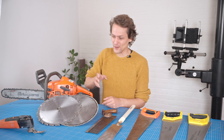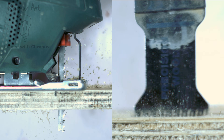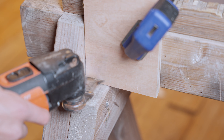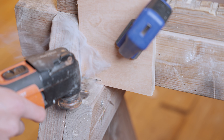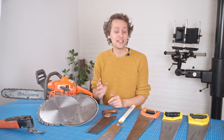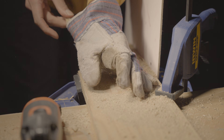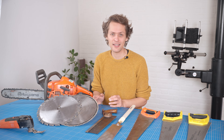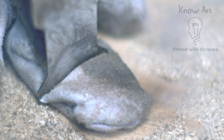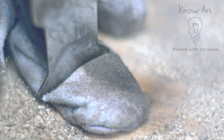One of my favorite saws is this — the multi-tool. Instead of vibrating up and down like a jigsaw, it vibrates sideways. This means you can push it into corners and stuff. It's super slow though — in all ways it's a terrible saw, unless you need it, in which case it's the only tool that can get the job done. It's also relatively safe: with a table saw or chainsaw you instantly lose your finger, but with this one it just vibrates back and forth, so it cuts hard things that are fixed in place pretty well, but has a hard time cutting something soft and moving along with the blade, like a glove.